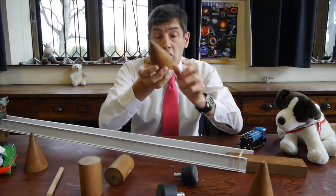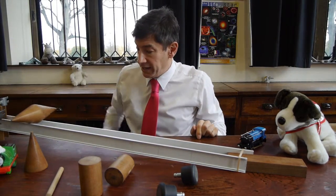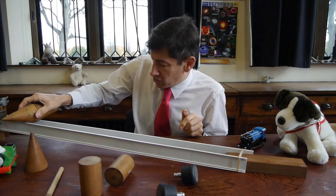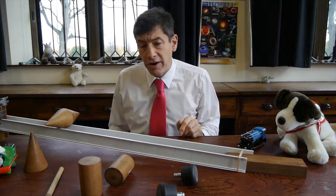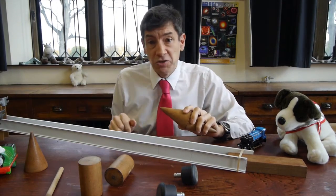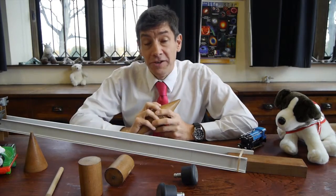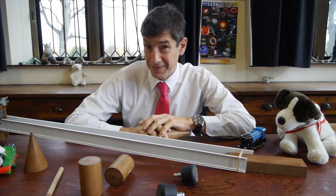Let's put our conical wheel set on the straight tracks and let it go. There it goes. I'll twist it slightly — did you see it wriggle its way down the track? I'll twist it towards you a little bit — and it centers itself again. This is very clever: the shape of the wheel tire, this conical shape, helps it self-center. Now you know how trains stay on the tracks, but I need to explain why this shape actually solves the problem — and that's the tricky bit.